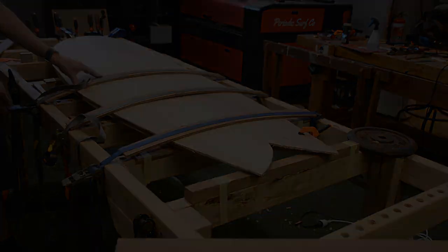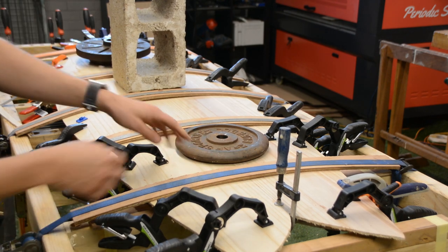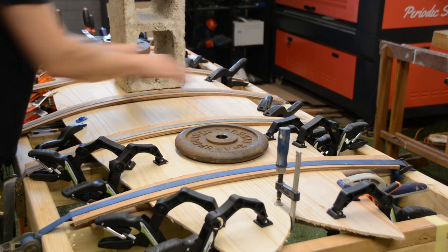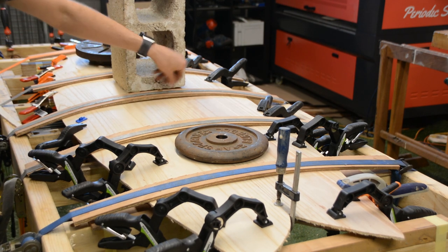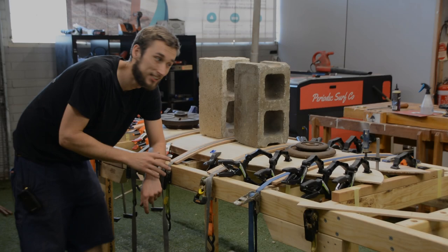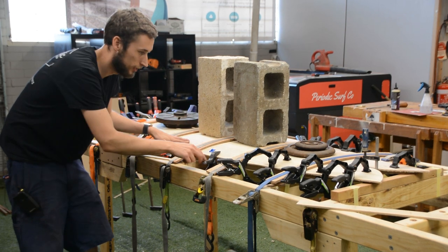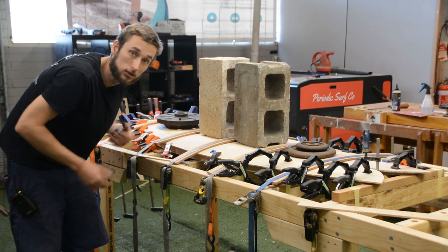You'll still need a few weights in some spots. Do all the clamps around the perimeter to hold everything nice to the rail, then press everywhere on the deck and check for any flex. If you have a void that really goes down, you know you haven't got contact to your frame and you'll need to apply some weight — we use bricks and dumbbells. The rocker table gives extra clamping options with the straps, plus plenty of space around the profile to apply clamps on the edge to ensure all of the rail has good contact.